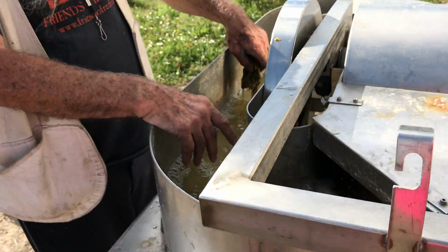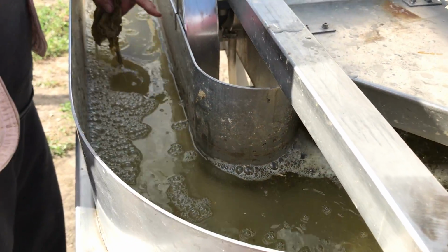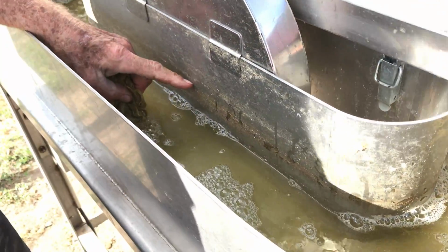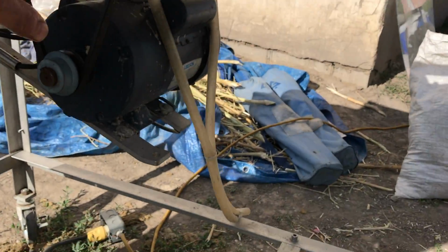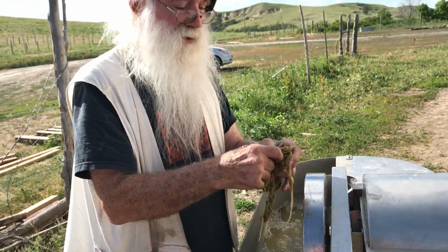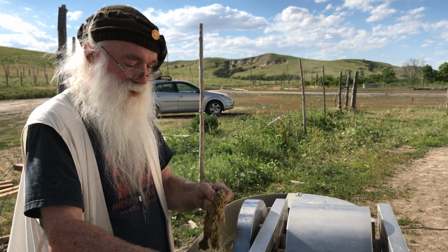It'll hold up to 10 gallons of water without leaking out, because the bearing is at about this point right here. And there are these plastic lines down on the bottom, one draining each bearing. And so if we get water coming out of there, we need to go and find out why. Okay.